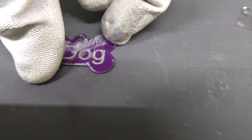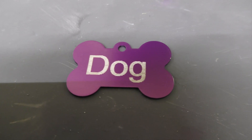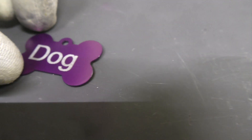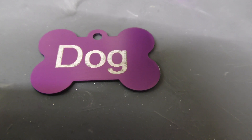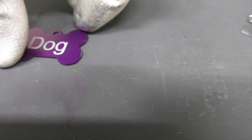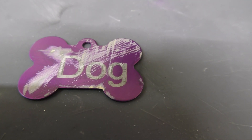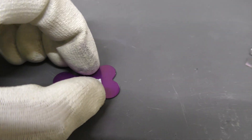I don't see any reason why I couldn't engrave these dog tags. As I say, you can't do plain metals, but this anodized one actually came out okay. I think I did one side at 20 percent and the other at 30 percent, and one came out just a little bit better than the other, but it's pretty clear. I've given it some abuse to start degrading the metal, so it may well be a viable option.